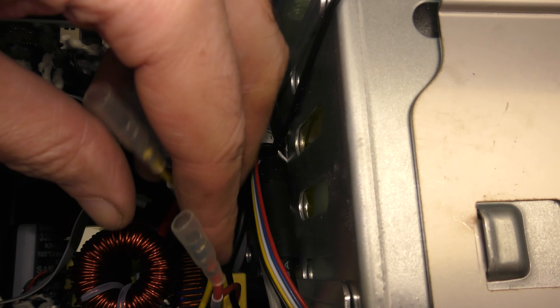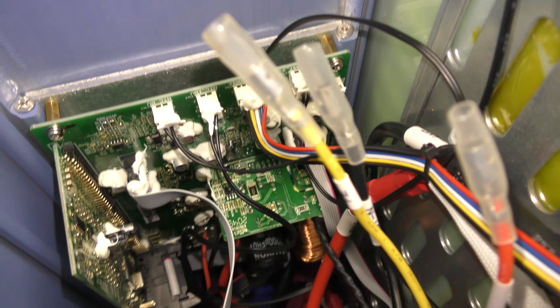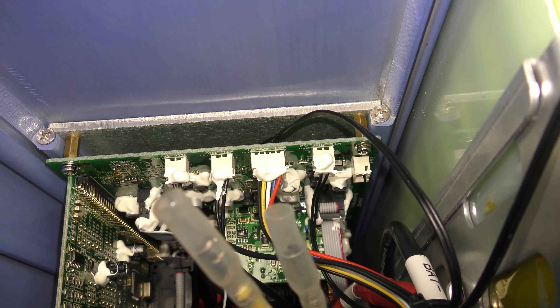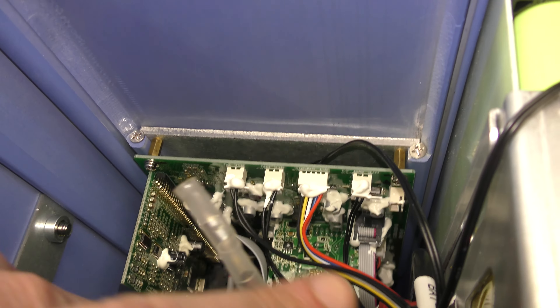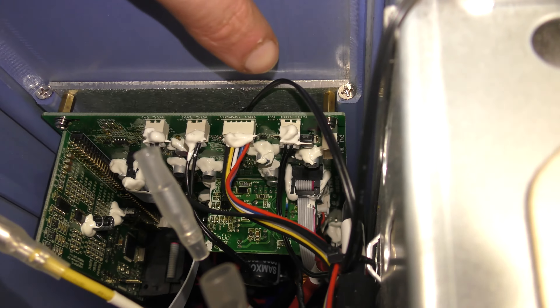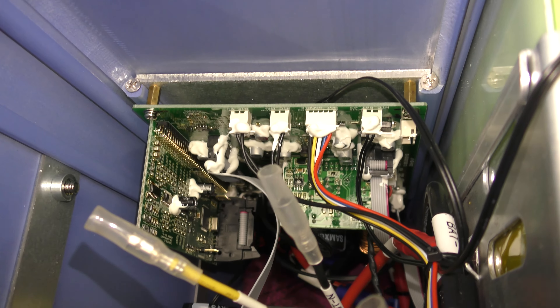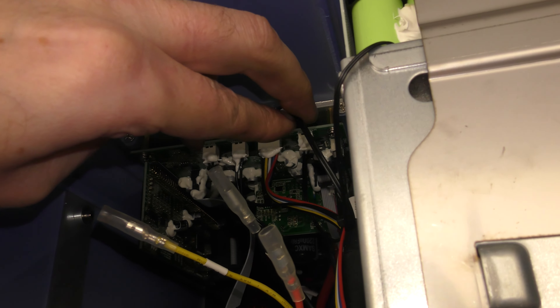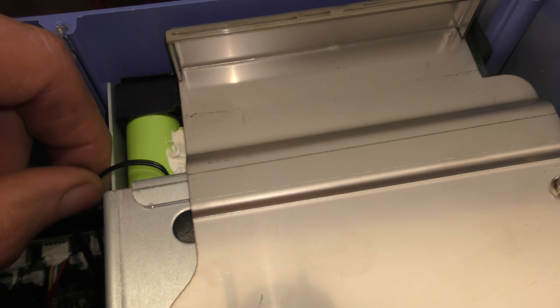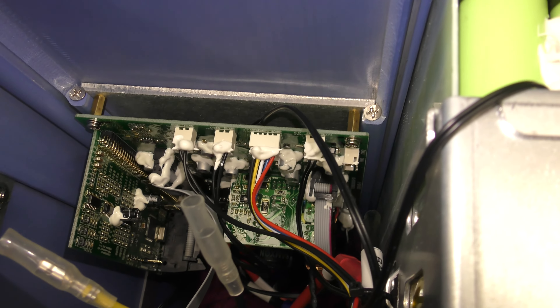Here we are back with the AC connections coming off this board, so I'm going to guess that's the inverter board and the other one is possibly for battery management. It looks like it's got a board on a board and another smaller board. Simply from reading upside down I can see 'Battery sample' on that one, which I presume is for balancing and testing power. There's also NTC battery, NTC inverter, and NTC PV — so there are lots of temperature sensors scattered around here, obviously to prevent and help with overheating. There's one going into the batteries — thermistors. So it's actually got temperature sensing, which is good.